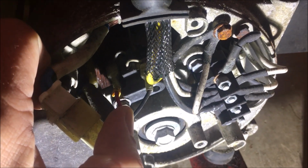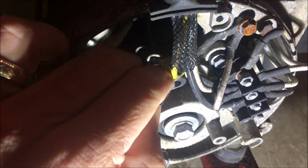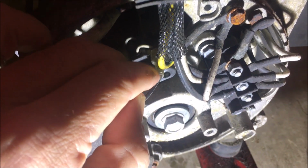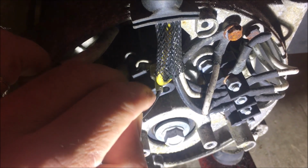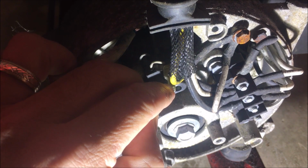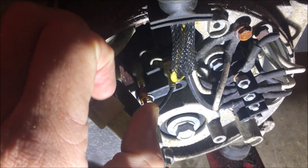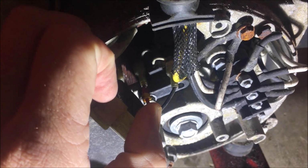So, if I was doing it directly on the slip rings, I'd expect a reading around 60 or 70 ohms. Through the brushes, it'll be higher, maybe in the 200 range. But that's fine. I'm just looking to see that it's not open circuit. And if it is open circuit, that tells me either the brushes are bad or there's something wrong with the rotor. So let me pull those wires off and get the meter on there.